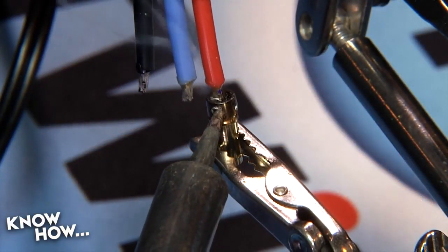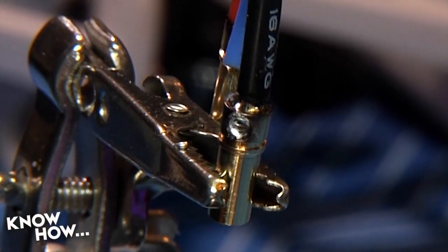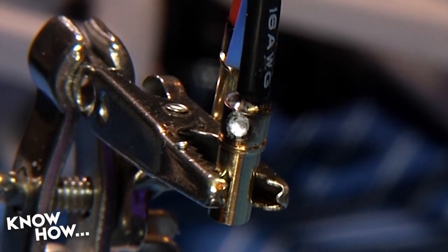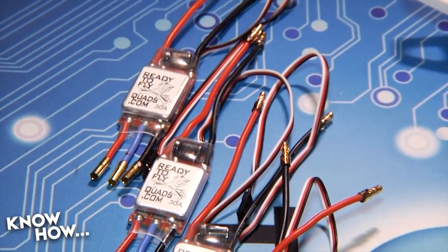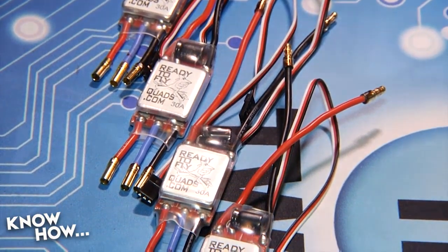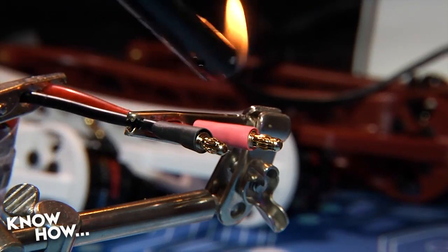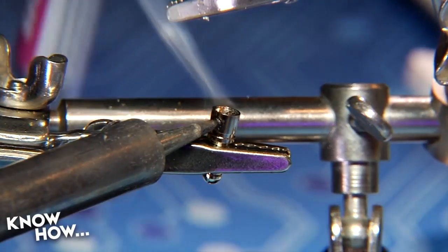Fill the cup halfway with solder, then insert your pre-tin lead. Allow the solder on the leads to reflow, then remove heat and hold the wire in position until the solder cools. Always double check your work, looking for empty mounting cups or obvious gaps between wires and solder. Once you're satisfied with your work, use heat shrink tubing to insulate the connectors, then repeat for the opposite end.